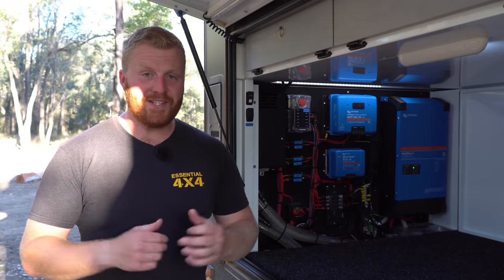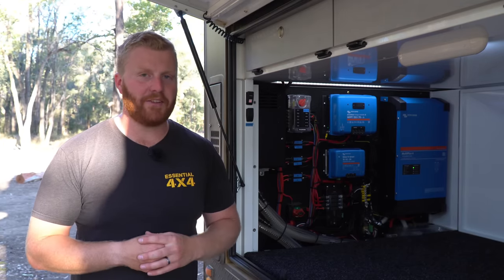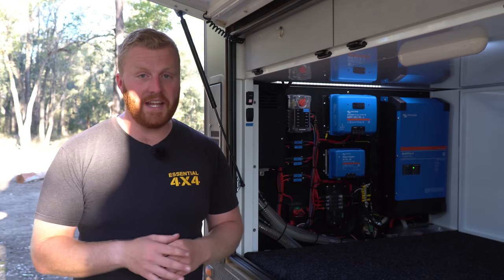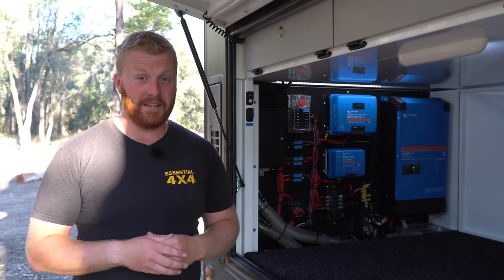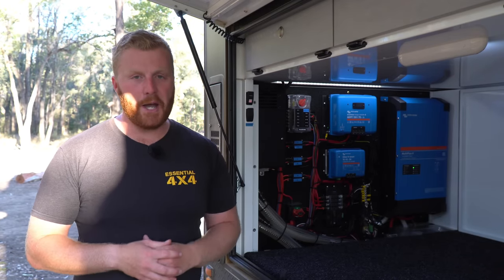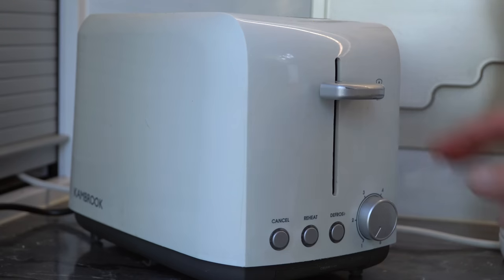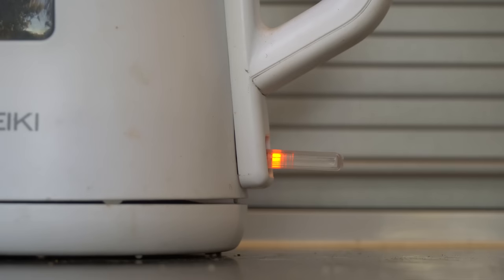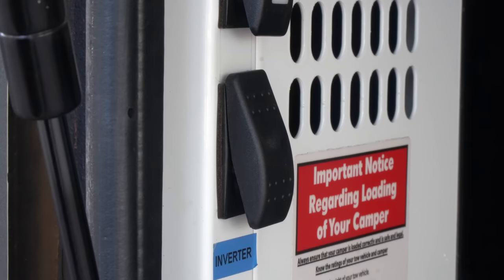This unit is an absolute monster in the portable power supply world and has to be one of the best systems on the market at present for inverter and charger setups. I'm not going to go over all of its features and specifications — it's well beyond my level of expertise and it would just take too long. But what you need to know is a 3KVA inverter is equivalent to 2,400 watts, which puts out plenty for a high-power demand electrical system. In our setup, we can draw up to 400 amps for a few minutes without difficulty, so we can have our induction cooktop boiling water as well as the toaster or the kettle if we want to.